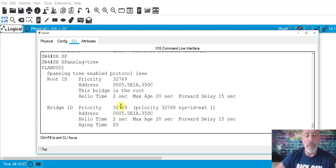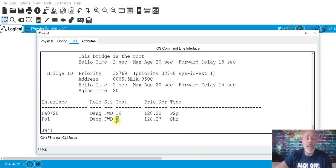At the same time it also has a lower MAC. You can see the root bridge MAC address starts with 0005. It's really because of lower cost — if you have two links and you aggregate, STP will make a decision based on bandwidth. It will never block a gigabit port because it has a cost of 4; fast ethernet has a cost of 19. So if you aggregate your links to 300 megabits per second, that will definitely have a lower cost.